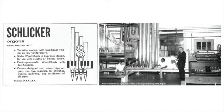And this is, I might add here, we have to cut the length on these pipes that do not have scrolls, and then we use a tuning cone to do the fine tuning. And this is simply flaring the pipe out or coning it in slightly. And will that change the way it sounds at all? Unless you abuse the pipe by hitting it too hard.